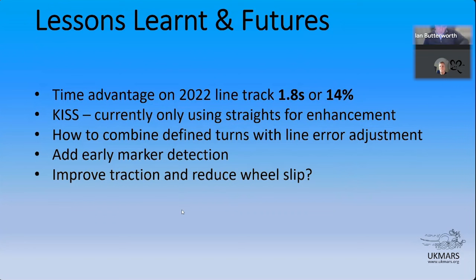So one thing that people do is they set their robot down, do some known acceleration runs, measure the shortfall, build a table, and then look up what they expect to lose for that distance and that combination of acceleration. So that's one thing. That's what the smarter people do.